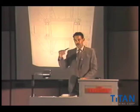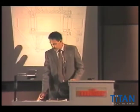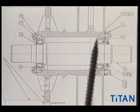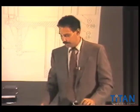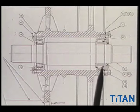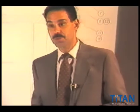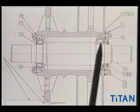The shaft is stationary and everything rotates on the bearings. When we put these taper roller bearings in as a rotating member, the outside race — illustrated right here — is pressed in position. They're fitted into the bore of the spider and act as one member, as if it was part of that spider. The other section of the bearing, the other part of the taper roller bearing, is pressed onto the shaft. So it acts as one member, and all of the rotation is done between the rollers. That's where we get our efficiency, our loading capacity. These are very high, very precise rollers that lend quietness, support, and efficiency.